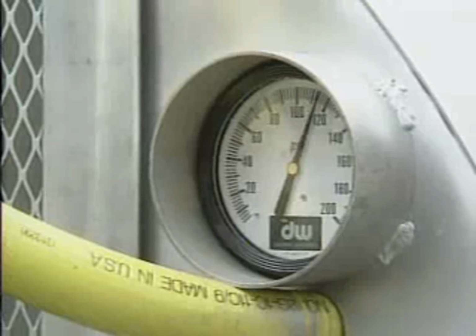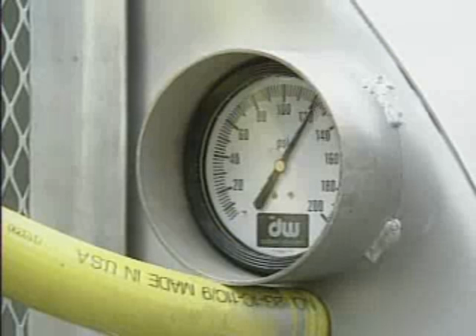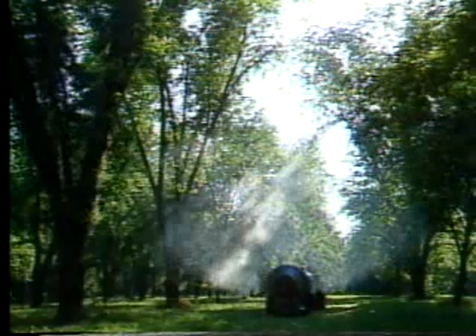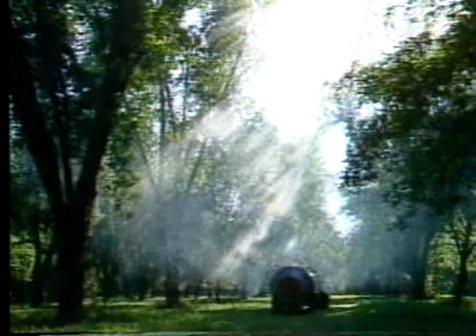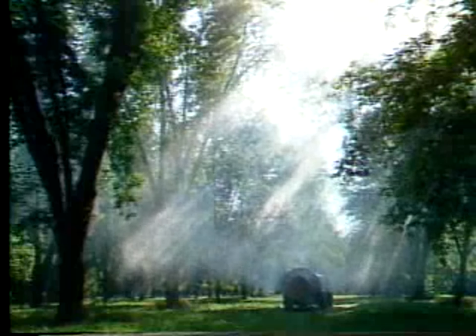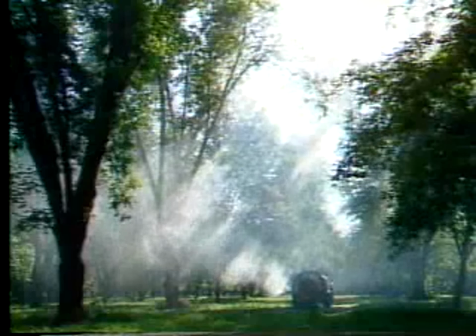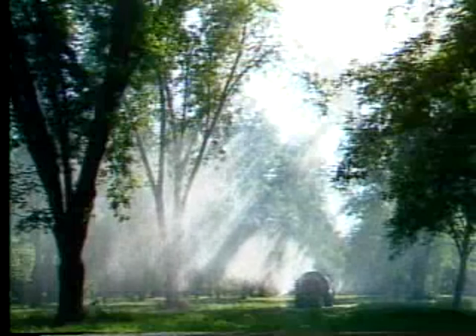You can make minor adjustments to output, if you so desire, by changing the pressure in small amounts. This is possible only if pressure adjustments can be made on the sprayer. A change in travel speed can also change output. After making any changes, recalibrate the sprayer to determine actual output.